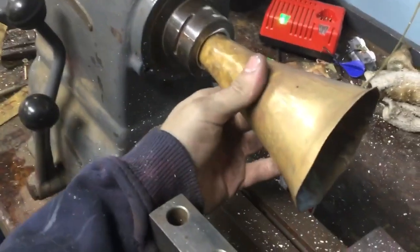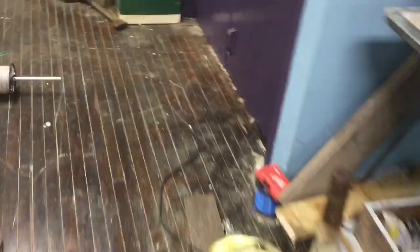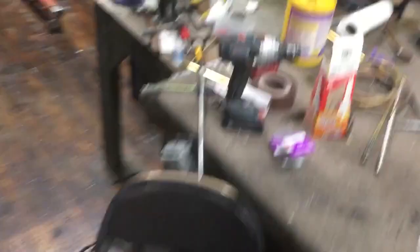I got a different chuck pattern because the old pattern was smaller and didn't fit my spindle right. This one's got a little bit of a gap and a little bit of a wiggle, but I did that on purpose so this thing is gonna wear in, and I can even open up the back with a scraper if I need it closer. It still grips, which is good. I gotta grab some wax — the wax is okay, it's not as good as soap. This is just paraffin, but soap makes me sneeze like crazy. I have really bad allergies.